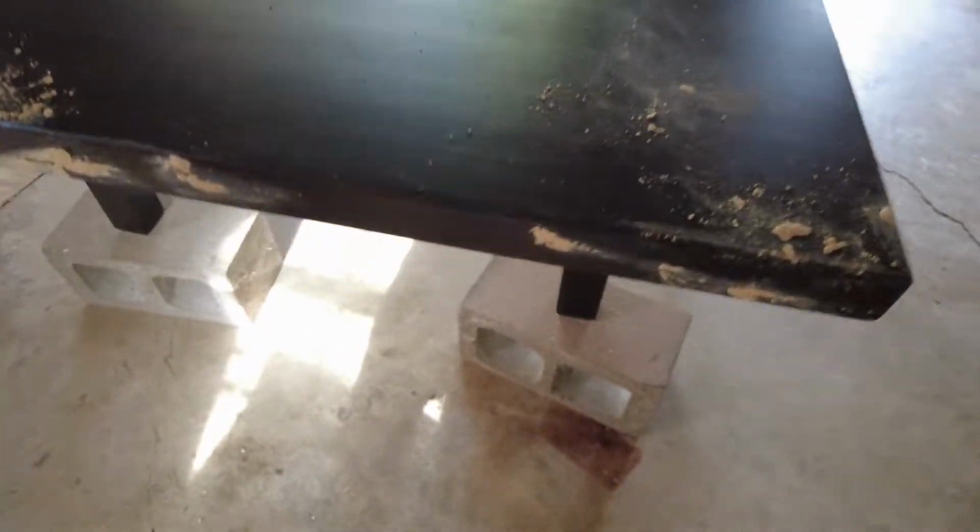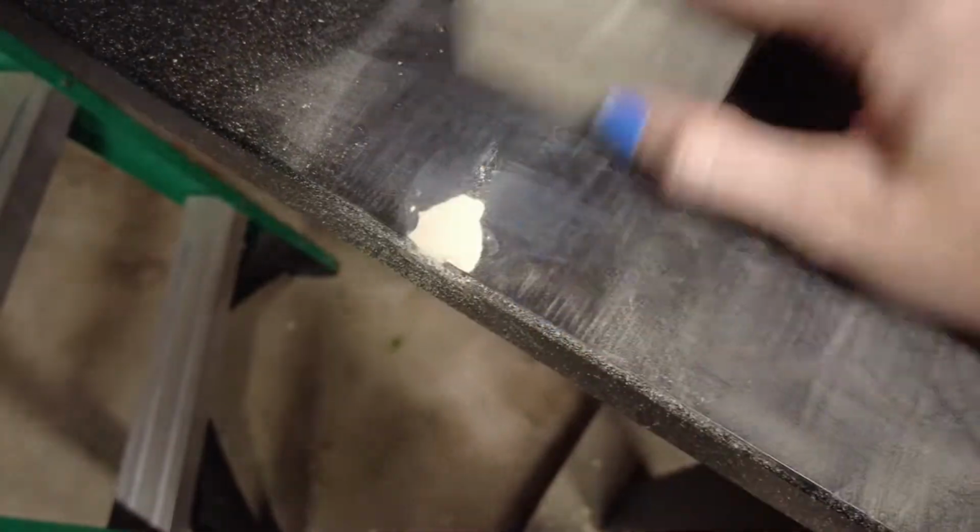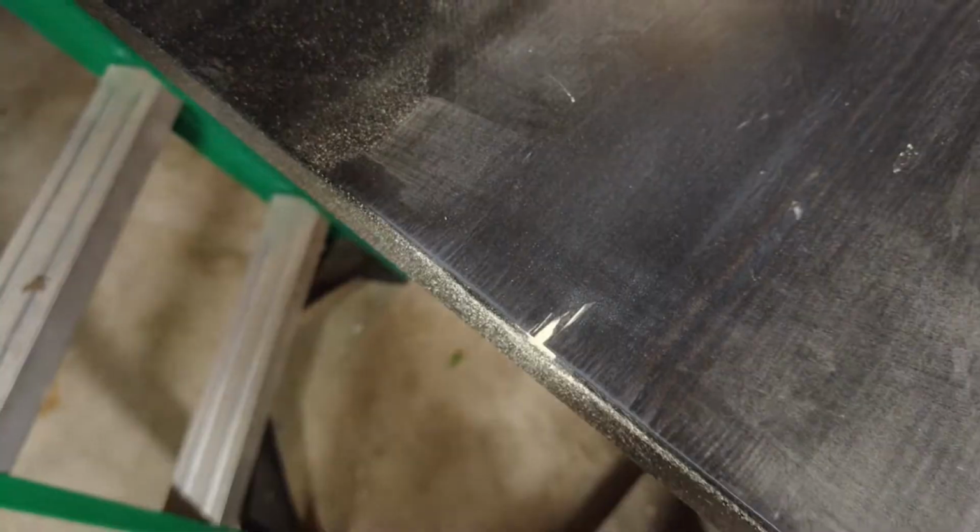After the surface is prepped, it's time for primer. It goes on in thin coats, so you may need multiple to cover the table completely. Since I was using a white paint and going from a dark color to a light color, I made sure to put on 2 coats of primer. The first time I used this primer, I was surprised at how quickly it dries. Now, when I tell you that this primer is magic, I am not kidding.